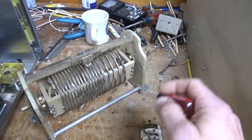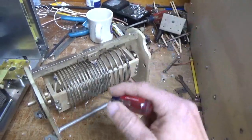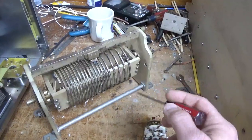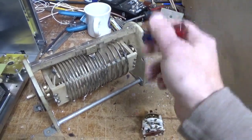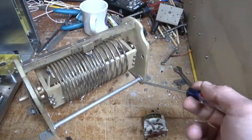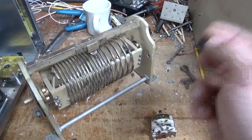It's just not a good idea. You have the 20 amp inductor and they use it on the lower bands, and you run into all those other issues I talked about, especially if there's more inductance. With the skin effect, you end up melting it down on the higher frequencies. It ends up being like a glorified SSB amplifier. You just can't get away with high duty cycles, AM or FT8 or whatever.